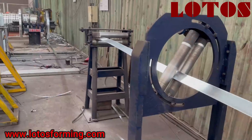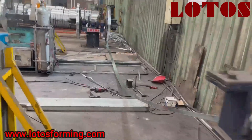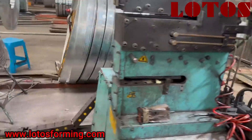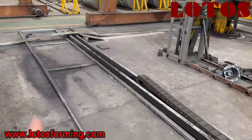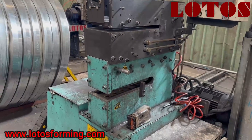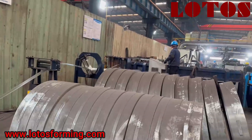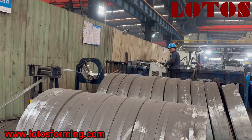So this is the fitting part of the tube mill. And while we join the coil together, we use this machine — we call it a butt welder. The butt welder can join the line or pull it out. Here is the butt welder; it can join the coil material by the end. So this is the completed line: double head, butt welding, and the accumulator. Then it goes to the forming machine with sizing machine and cut off.